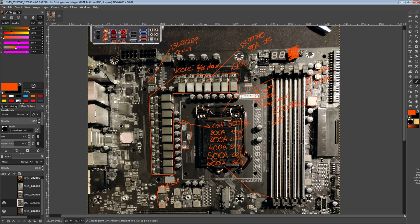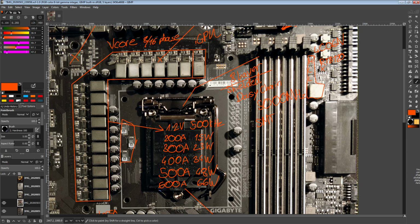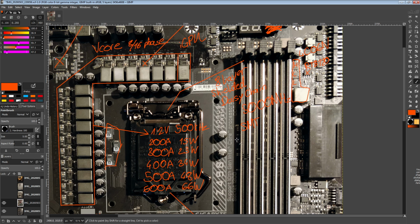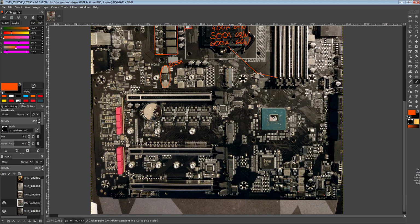You've got basically Gigabyte's best VRM, and then Gigabyte's best 4DIMM memory layout, and I just kind of wish we could get those things at a cheaper price. Well, actually, the VRM on the Master is already good, plenty good. I just wish we could get that memory topology on the Master, with the SMT DIMM slots and the 8 layers, well, honestly, maybe not even the 8 layers. Mostly just the SMT DIMM slots could be really, really cool to have on a cheaper board.